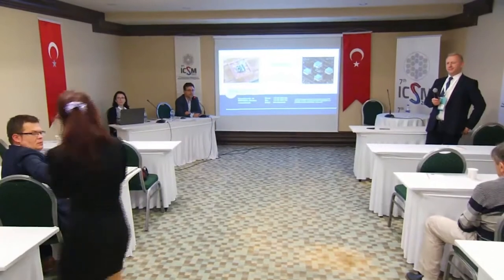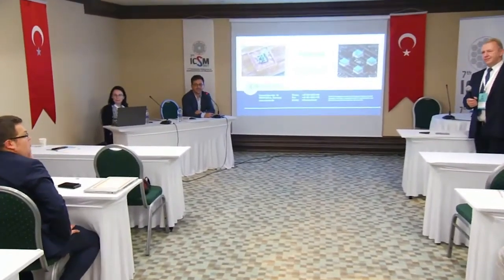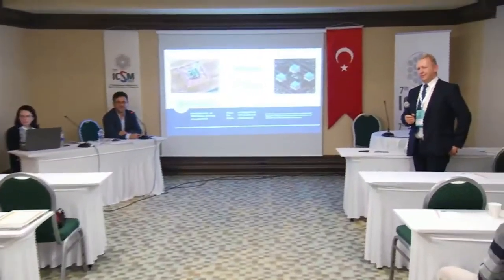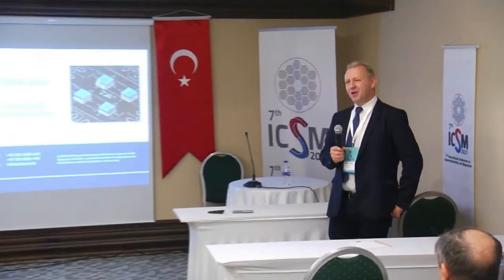Is there a question from the online site? Oh, yeah. How about the operating temperature of this hybrid system? It's a very good question, because so far the limiting factor is the CMOS, which doesn't go below 3 Kelvin. And the transmon qubits will be at 10 millikelvin, so we still have a challenge.